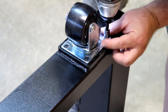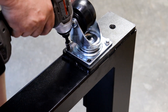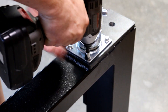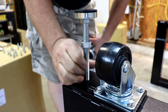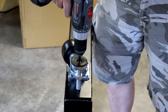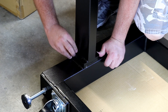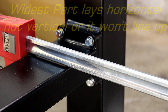Make sure to set the chuck on the drill so that you don't over-tighten and possibly strip out the screws. First start by hand-threading your bolts, then with a straight drive bit or flat bit you can screw it in much faster. One thing we ran into was aligning the bolts for the cross members — we fixed this easily by using a clamp and holding it in place.